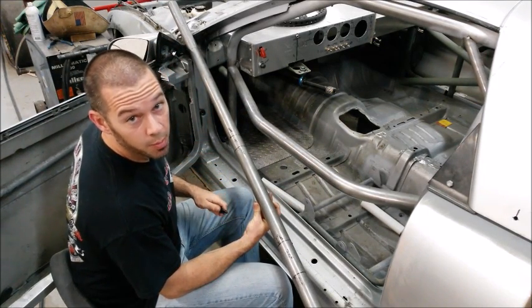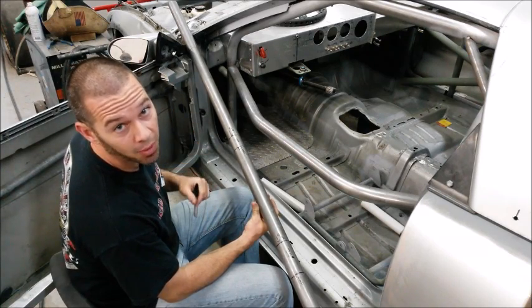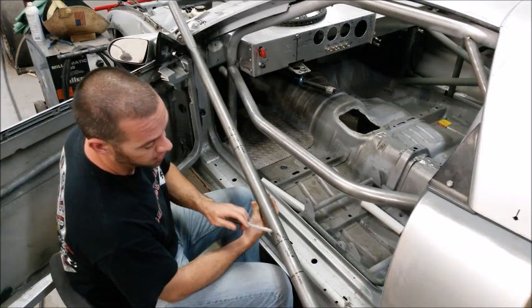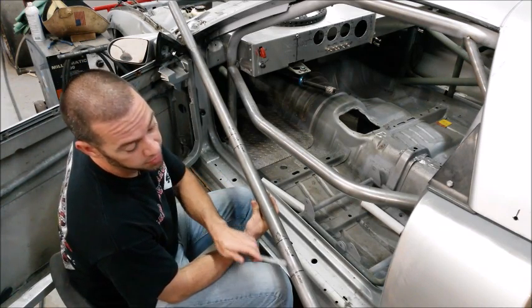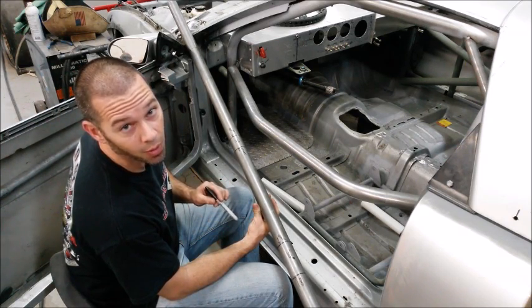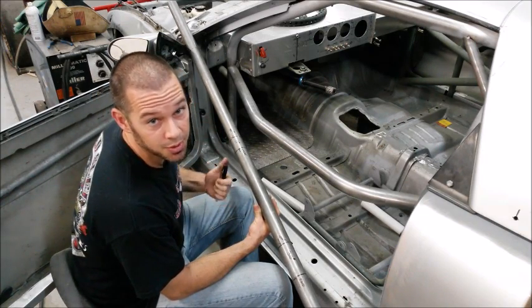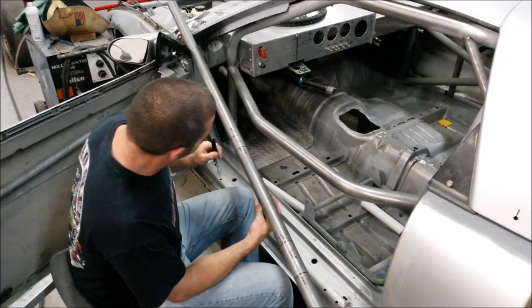All right, we're ready to make these bends. Just a couple more points to bring up before I go hop on the bender. I laid this out with the starting and end points of where the theoretical start and end should be for the tangents of the bends. So we'll see how accurate it is and how well it comes out. I guess if it makes a liar out of me, you guys aren't going to see this because I'm just going to have to edit it out of the video. But I'm pretty confident it's going to be right.